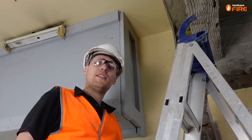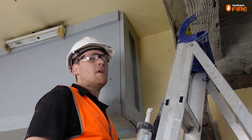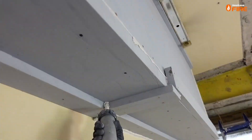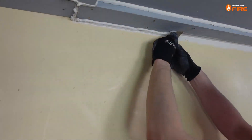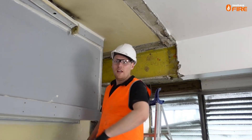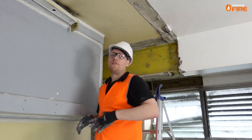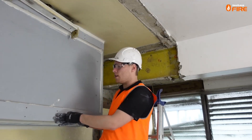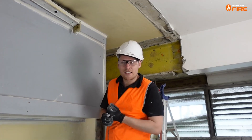The very last thing to complete this installation is to seal up the cover strips and apply a fillet of sealant between the bulkhead and the wall and slab. A common misconception is that people always seal up the screw heads — you don't need to do that; if you want the aesthetic look that's fine, but it will save you time if you skip it. With the cover strips, if you want a better aesthetic you can plan the joints to look neater, but in this application we don't need to worry about aesthetics.